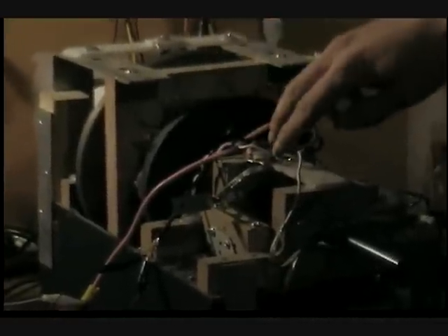The gist of that is that these two — the coil comes in and at the same time it comes to a commutator section, and I'll show more how this works especially when I put it together on the other machine. Essentially, one comes off to the brush on one side, and the other side of the AC end comes down to the switch and from the switch back up to this side.